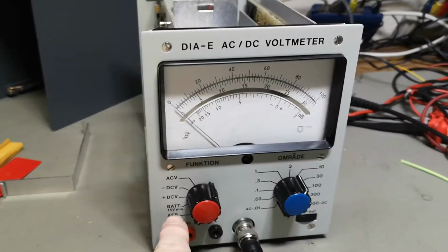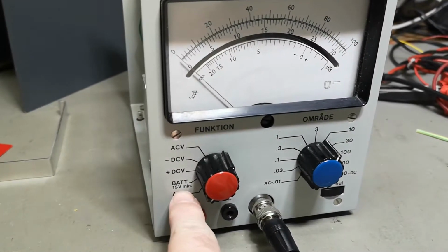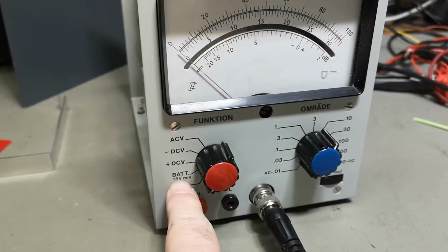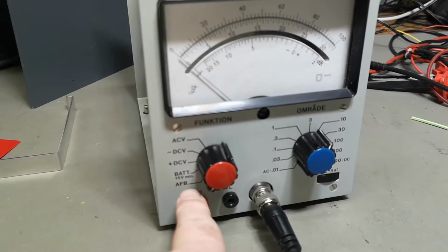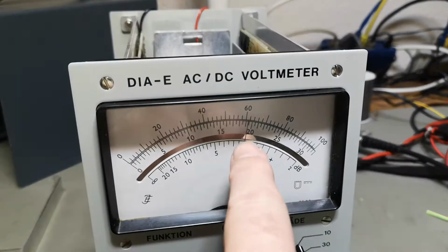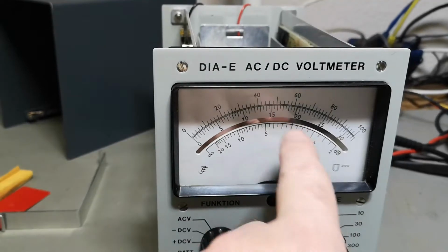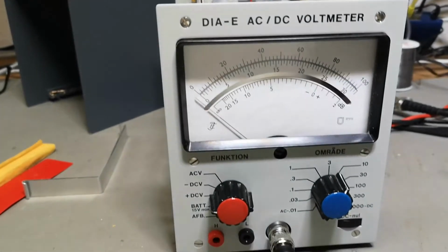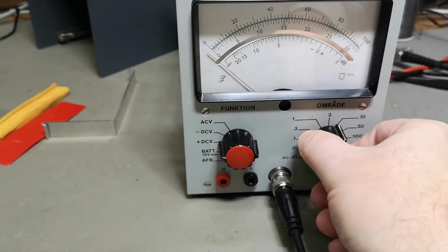So here's my take on this. If a battery is okay or acceptable minimum at 15, it's probably 18, because it's two 9-volt batteries in series, right? So it's probably 18, that's the nominal voltage. So this is what I'm giving it. And the voltmeter here also reads the voltage. So I guess that is it. And if I reduce the voltage to 15, it goes here. So that's all fine. Then we go to the DC, and it hammers to the negative, and it's not responding to the DC zeroing here, no matter what the heck I do, right?